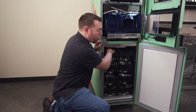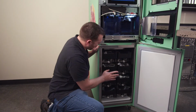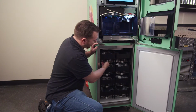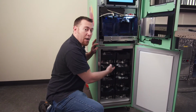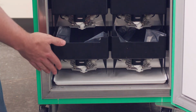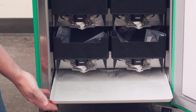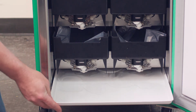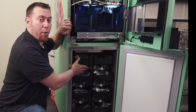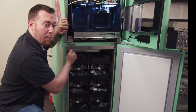You look on top of the product bags. If it's on top of the product bags, that's usually somewhat of an indicator of some water coming through during cleaning. So if you're seeing a lot of water all the way down at the bottom, in this tray at the bottom, you pull it out like we see here, we've got water sloshing around, and you're absolutely sure that it wasn't cleaned without a product bag in place, then we're going to want to look up towards the top.